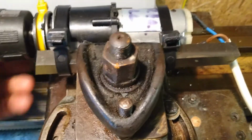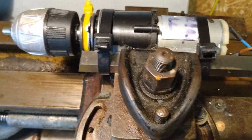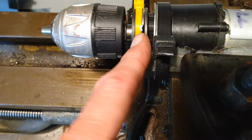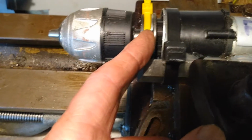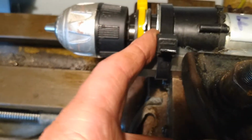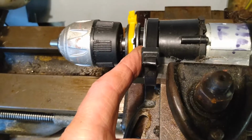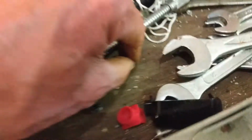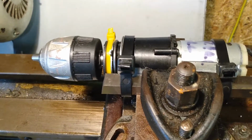So there we go, inside of a drill. So I've taken the drill apart. What have I done? Well, taken the casing, thrown it away. I've put a tie wrap around this part here to keep spring tension onto the disc that is used to adjust the torque setting, and I found one of the torque bits. What you'll find is, if you pull it apart, that little billets like this will fall out. I don't know if it's different on other drills, but anyway, they go into notches inside this gearbox arrangement to provide you with your torque setting.